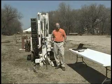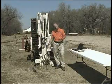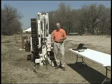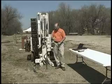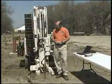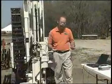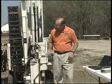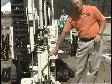This is a typical setup for slug testing in the field with a ScreenPoint groundwater sampler. What I did this morning was advance this tool down to about 50 feet, retract the screen sheath, and expose about one foot of screen. We're just going to go through and run a slug test and quickly show you how the system works in the field. You can see here the pneumatic head is installed on the probe rod with the ScreenPoint 15 in the ground down about 50 feet.